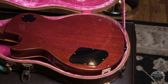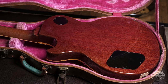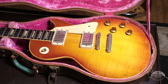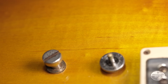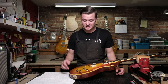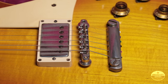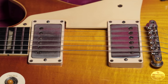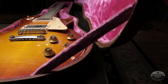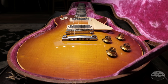The back should be one-piece mahogany with no center seam, filled with contrasting grain filler — that's why the grain is so pronounced. The top is a center-seamed eastern maple top. Not much flame on this one, but something really indicative of eastern maple are darker mineral-deposit streaks, distinct from the western variety. If the top seam on your burst is not centered, it's very likely a refinished gold top — gold tops almost never had a centered seam, whereas every burst did. The seam here is right on center and super tight. The contour was pantographed but finished by hand; this is the perfect carve.